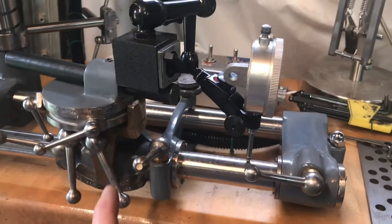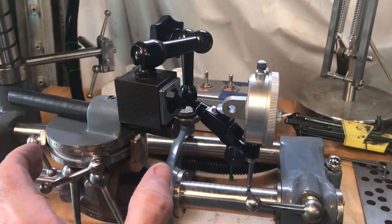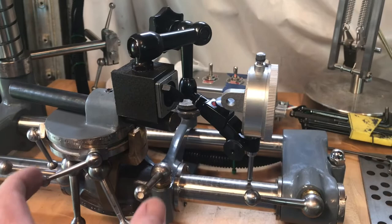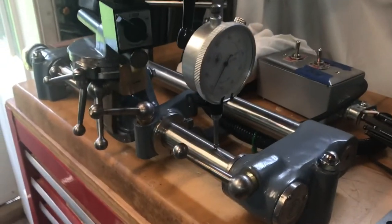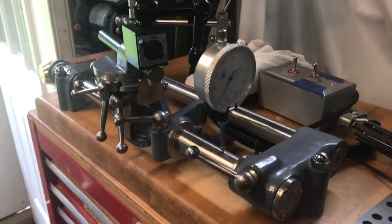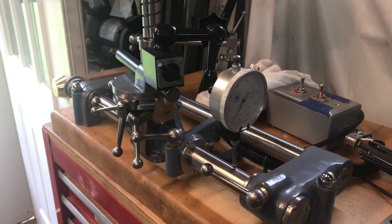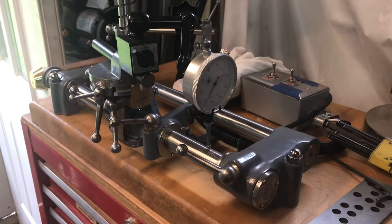It's really tricky because you're loosening this ball handle here and then just using muscle force to gently align it. It's frustrating to be honest to get the exact zero — that's part of the reason I don't want to film it. You get the idea: just go back and forth, sweeping the turnaround test till you get it zeroed out. That's what I'm going to work on next.